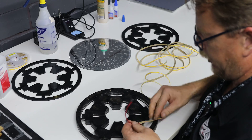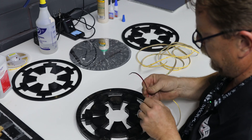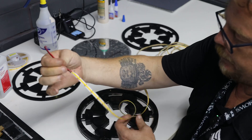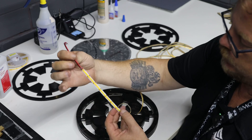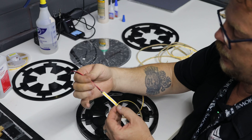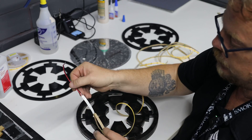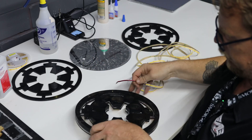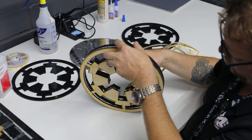The next step is going to be to wrap the LED around. This will probably be sped up. This particular LED strip is a continuous light — it has a channel on top that diffuses the light so it looks like one solid light. It's 8mm wide by 2.5mm thick. It's got double-sided tape that you peel off, so we'll be able to stick it all the way around our piece. We have our channel that we cut, so that's where the wire will come out of.